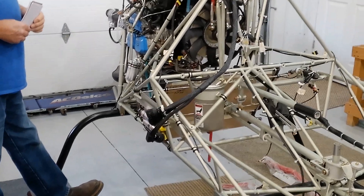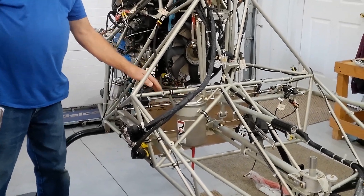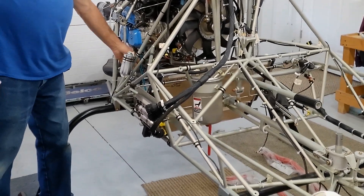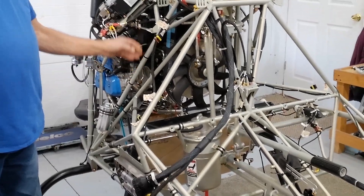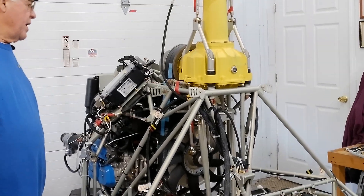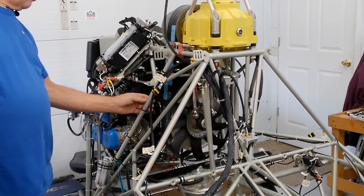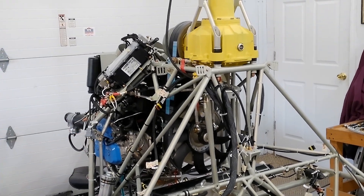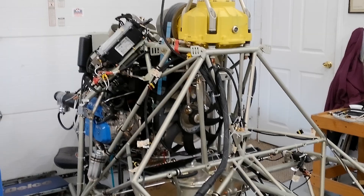One of the other things I did was the vent tube — the vent hose from the oil tank going down past the engine. There's also a drain tube that goes to the gearbox here, so that if there was a leak in a seal, that would relieve the oil and you would know you have an issue with your gearbox seals.